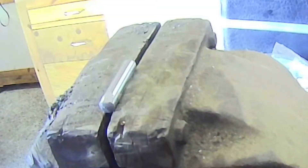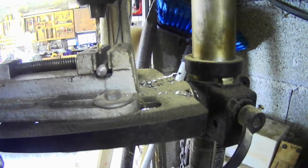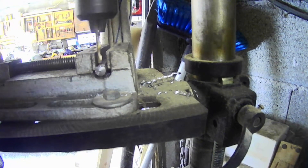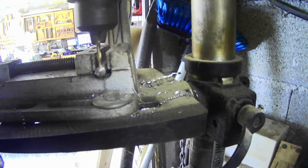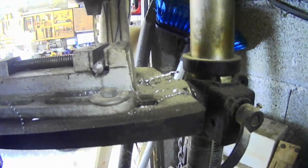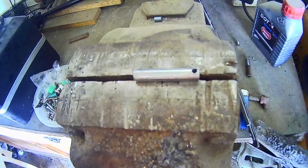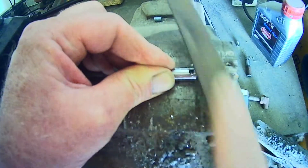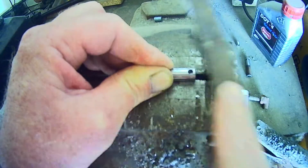Next thing — the drill. I've now got it set up in the vise. I'll just drill a four millimeter hole straight through the middle. And there you go, that's the hole done. I'm just going to run a file over the back of that just to get the burrs off. Lovely.